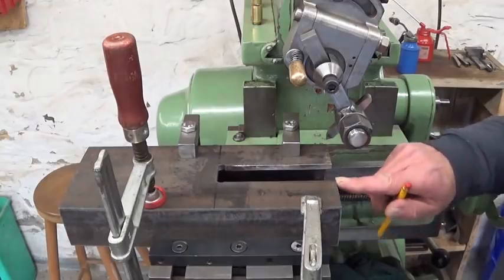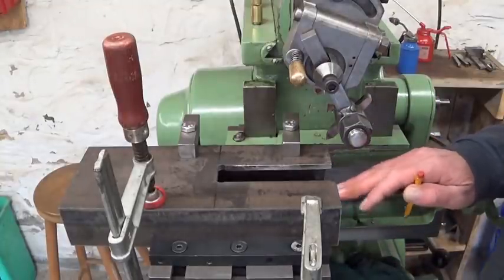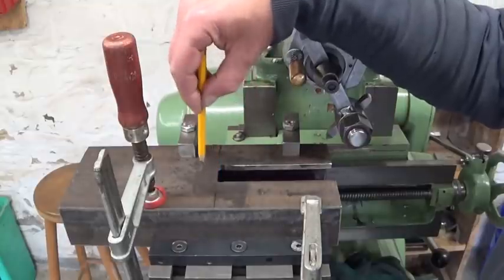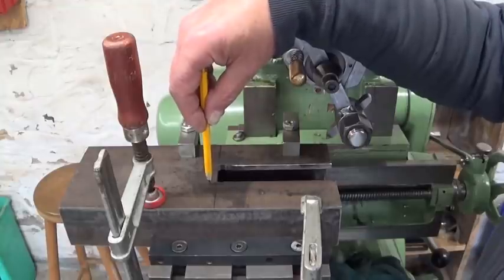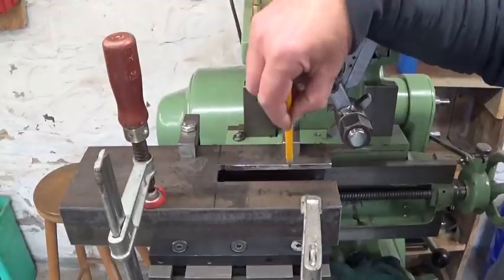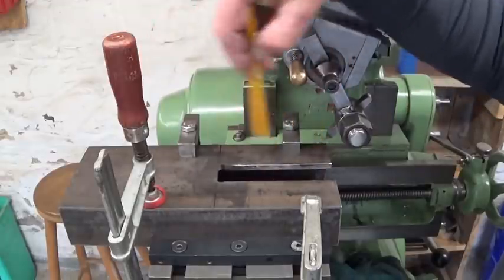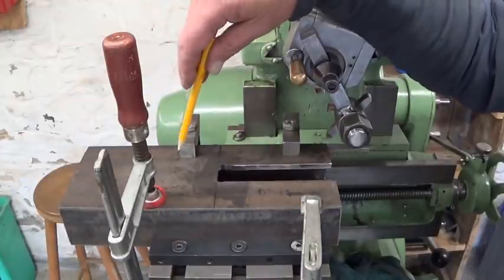First, I'm gonna clean up this surface a bit, just to have it clean, nothing special. It will be more or less square. I'm gonna cut a groove here somewhere, no specific dimensions, it's not important. And this groove is gonna serve me to break the chip. I'm gonna cut these two small surfaces here on the inside, and after I'm gonna do the top surface, but the part is too long to go completely in the shaper, so I'm gonna do it in two times.